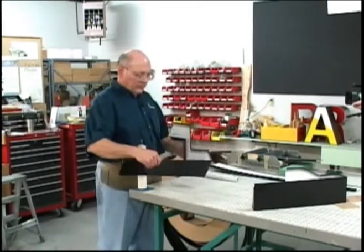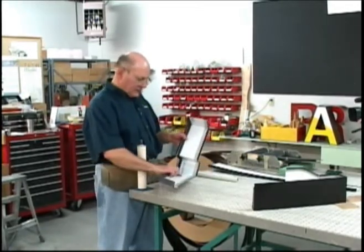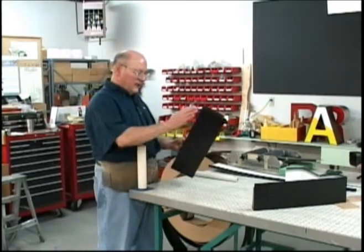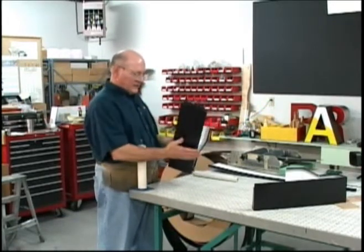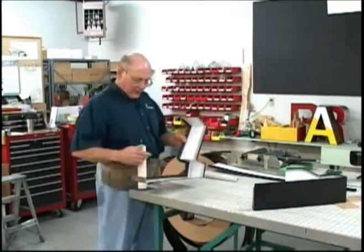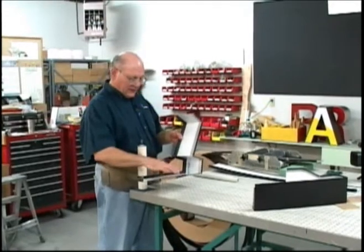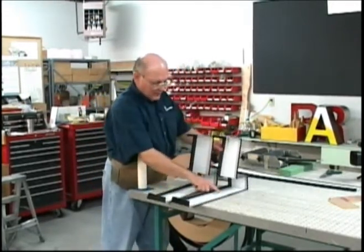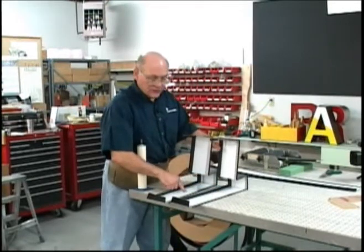Okay, the rolling procedure for the arcs. This is an arc up because the material is going to be bent around the outside of the letter, so that's an arc up. We use the roller. We have the beginning and ending of the material marked of that arc, whether we're using the paper pattern or whether we're using the hand measuring.